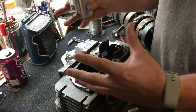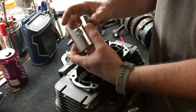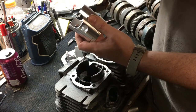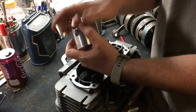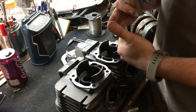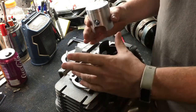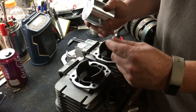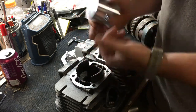That's because this is an air-cooled engine and you've got a lot of things expanding. There are also ribs on these pistons — you can feel them like a fingernail file running down your finger. Those ribs are designed to wear into the motor, so that first break-in when you get these back from your machine shop is so important.